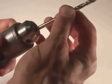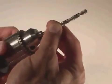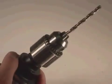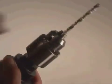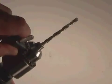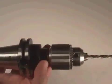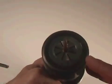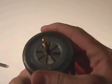Attached to some of the tool holders are chucks. These chucks are used to hold drill bits. You tighten that up by hand, then use the key to make the final tightness, and you've got the drill in there. Occasionally you may see something called a collet. You loosen the ring with a tool, the collet opens up, and then you can pull the tool out.